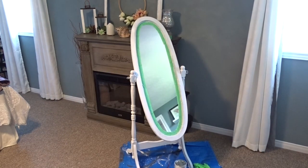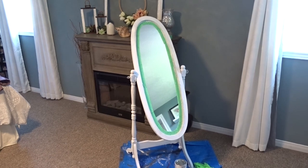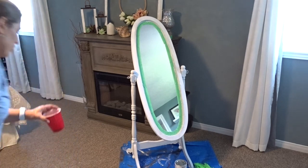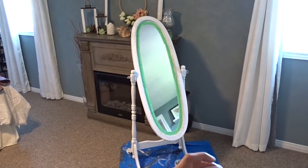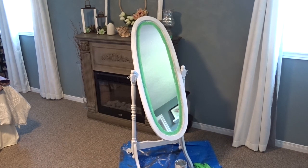I gave about one and a half coats of white and let it dry. With chalk paint you don't need to wait too long — probably about half an hour to 45 minutes. After about 45 minutes I mixed up my French linen with water. The ratio is one tablespoon of French linen paint to three tablespoons of water. It's really up to you how watered down you want it — more water means less paint, less water means more paint.